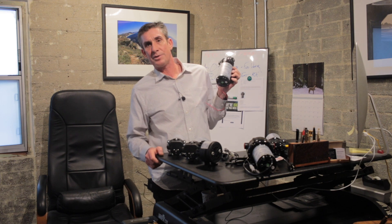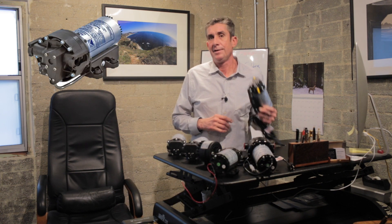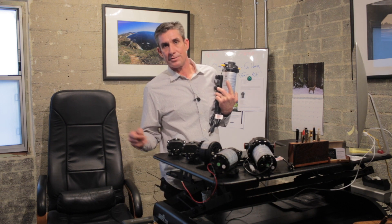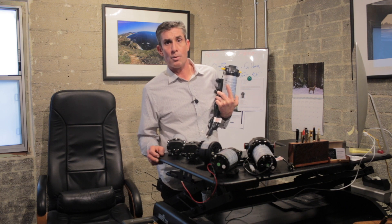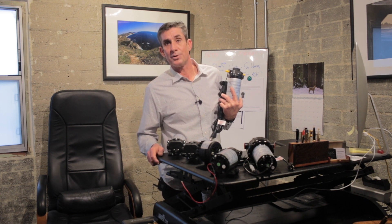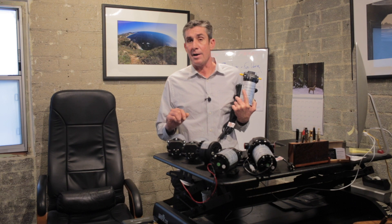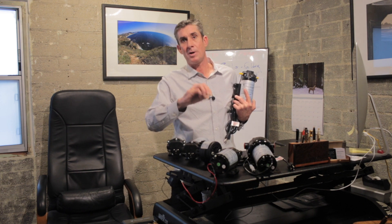Now if you don't know exactly what your demand is, we have variable speed. A variable speed pump senses your demand — you don't need to do all the math I just described. We get a lot of calls where guys think they know what the coffee maker, ice maker, and glass fill station are using, but typically unless you're there with spec sheets you won't really know. You may need to add accumulator tanks along the way to ensure water at all those sources. Adding an accumulator tank also eliminates cycling the pump — where it turns on and off repeatedly because your demand differs from what the pump is trying to output.